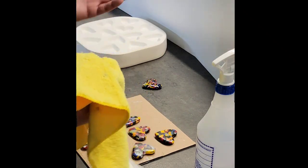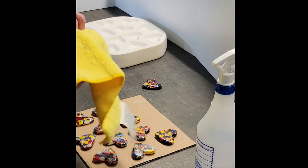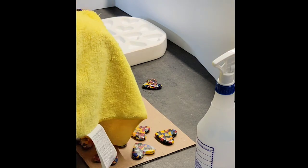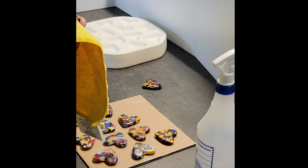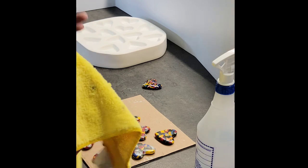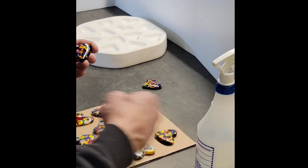The reason we flip these over is you don't want to dig them out of there, because there's a good chance that you'll scratch the coating off, the zip coating, and then you'll have to respray it. This way, if we tip them over and they fall out nice, then we should be good to load that up and refire it a couple more times.